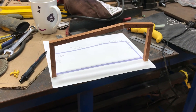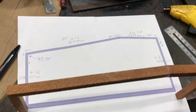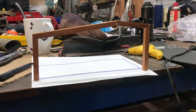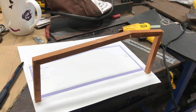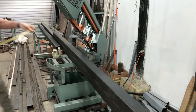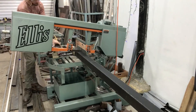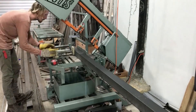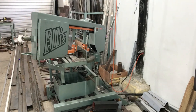Right here is the model of the roof line of the tiny house — here's the drawing I did with all dimensions and angles — and I did it out of wood to double check everything, make sure the angles were correct and that I liked how it all looked. We'll be doing this out of three-inch square tubing. I'm using the Ellis 1800 miter bandsaw — one of the few companies still making bandsaws in America — extremely well built and it makes cutting angles in metal very convenient. But you could also use a Milwaukee porta band or just an angle grinder, which is what I end up using for a lot of this type of work.